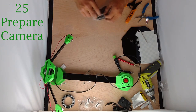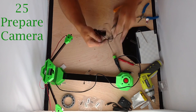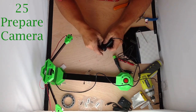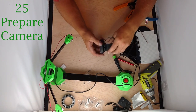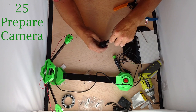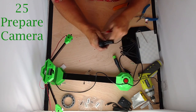Now take the camera — peel it out of its bag. This takes a little bit of further disassembly. Untwist the twist tie, get the wires. This face plate — there's a little notch there, grab that and pop it off, we don't need it. We also don't need this whole thing in the back. Now there's a little rubber gasket right there. Reach in with your screwdriver and pop that out from the top — that's the rubber gasket you want to take out.